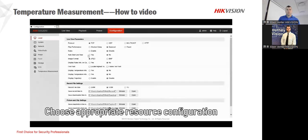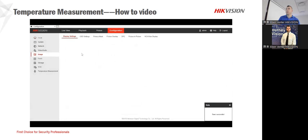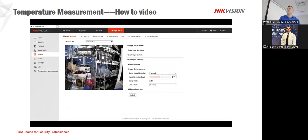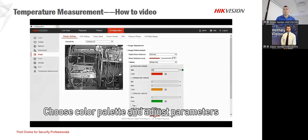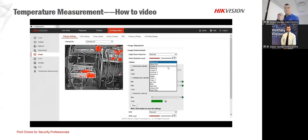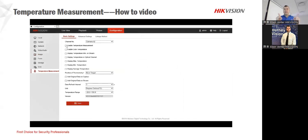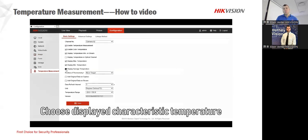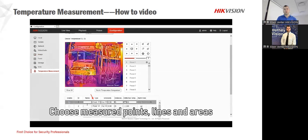Here we log in to the camera, select it, and enable the rules so we can see the rules on the display. This is in a server box — this is actually very nice. It helps us to look after the switches. By each switch, draw a little block by the power supply, put your temperature in as an average, and if it exceeds it, it will warn you. If it drops, it tells you that it's switched off.